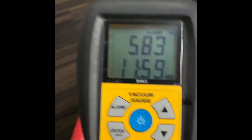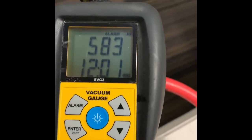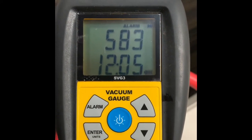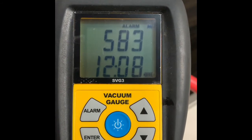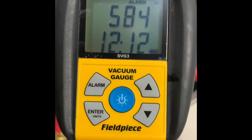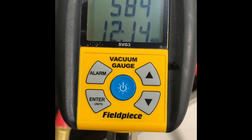So what I want you to do — get a picture. That's going to go in Desco. And now we have the evidence, the certificate of a leak-free non-condensable system. This was just an opportunity to show you the standalone field piece micron gauge.